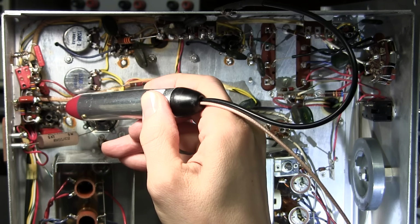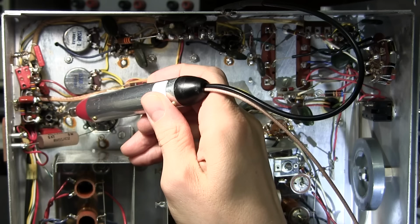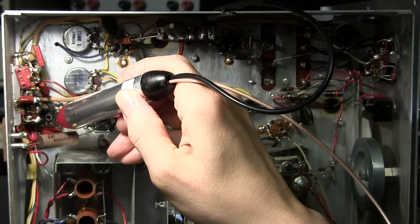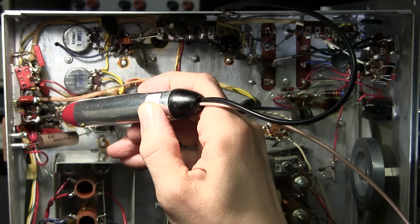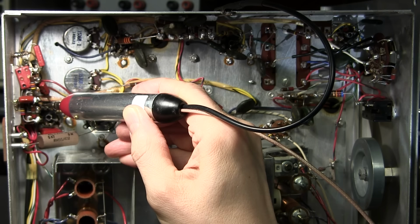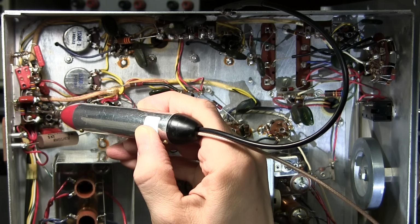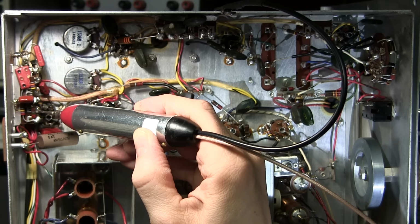Pretty noisy there, but well, pretty close to the same. So I'll just bring this over this capacitor here again. Now this probe is nowhere near as sensitive. So this is attached to this capacitor down here, directly to the cap. And this is attached to a resistor here. Just test stuff around here. This is on the other end of that resistor. Now there's also a cap going to ground off this, so if there is any kind of sparking or arcing inside that resistor, it's not going to be too present at this end.